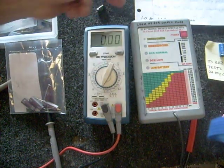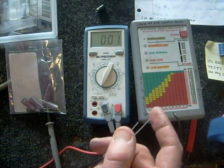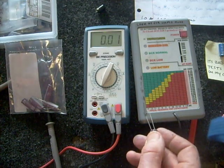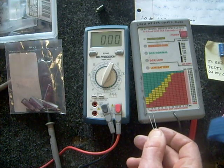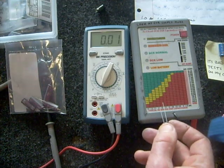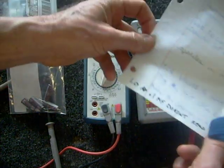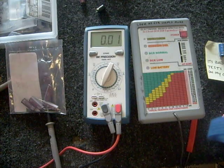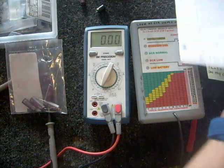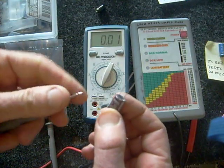Sometimes very low-value capacitors, like 1 microfarad, don't always show up on my meter, even though it goes down to 0.47 microfarad. When they're old, sometimes they don't show up, and I'm not always convinced I have to replace every one that doesn't appear on my meter. When replacing caps, make sure you go with high-temperature caps if the circuit calls for them.